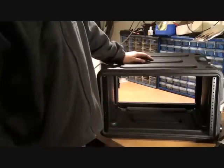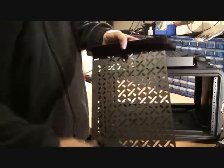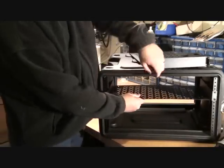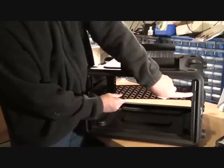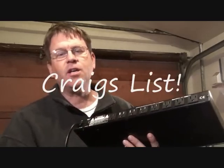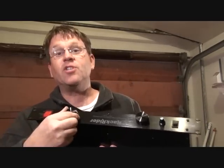For my setup, I'll need to put some equipment in the back as well. Let's take a look at what you'll need to order if you go this route. There are rack systems called a half rack or half tray, and this will slide right in — you get some hardware and just apply the screws to the position where you want it. Before I started this project, I did a little mock-up to know exactly where I'd need the trays and how to line all the radios. One of the neat features on the WI5J setup was the use of a rack rider. It has two components: on the back, an eight-plug AC outlet — so a power strip is already incorporated in your setup. On the front it has the on-off switch, and in dark settings, it has lights.